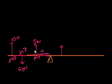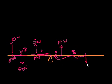I'm going to keep it all the same color, and then we'll use colors to differentiate between clockwise and counterclockwise, so I don't bungle everything up again. So let's say I have a 10-Newton force here — of course these vectors aren't proportional to what I drew; 50 Newtons would be huge if these were the actual vectors. And let's say that moment arm distance is 3. And let's say I have a moment arm distance of 8, with a clockwise force of 20 Newtons. And let's say at a distance of 10 again, I have my mystery force, and it's going to act in a counterclockwise direction, and I want to know what it needs to be.